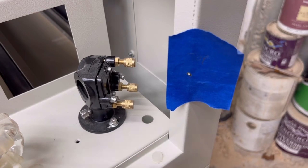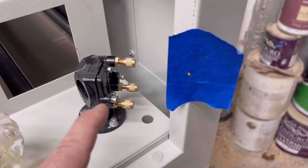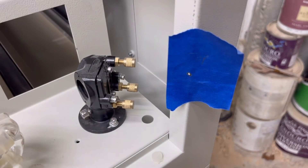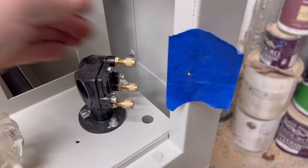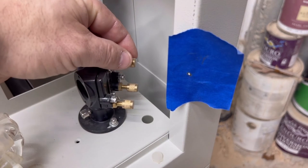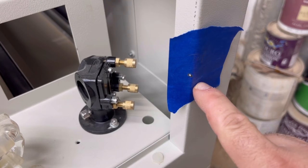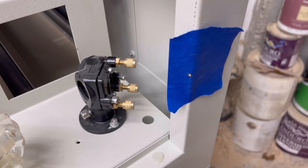Okay, so we're back at mirror one with the tape. Let's say hypothetically yours were not even close to aligning. You're going to take an 8 millimeter wrench and loosen here, here, or here. This one is for up and down, this is for left and right, and this is for diagonal. It's very sensitive, so even the slightest turn will make a difference. Loosen one and give it a slight turn in the direction you want to go. Keep the tape in front of you as a reference — if the mark was down here, maybe you want to go diagonal, or left and up.